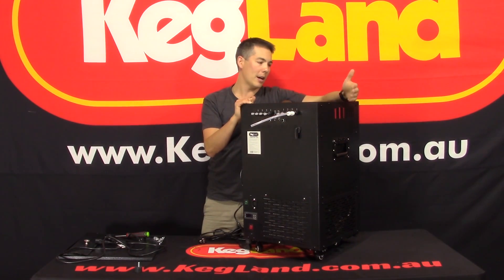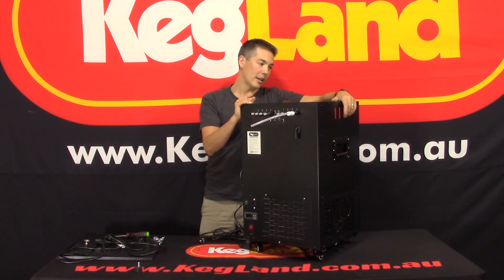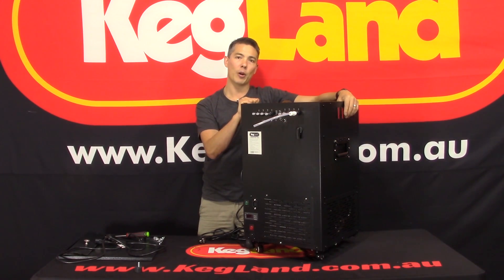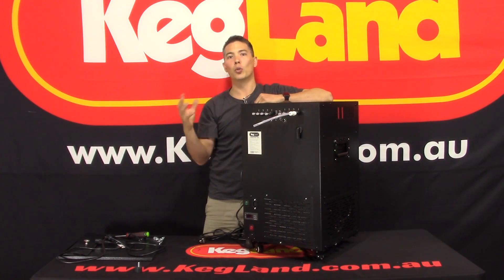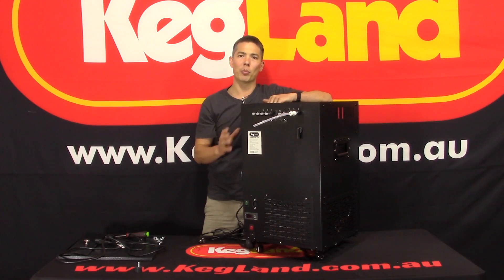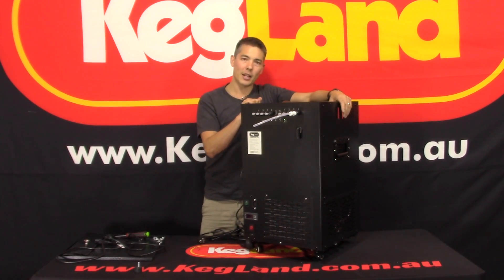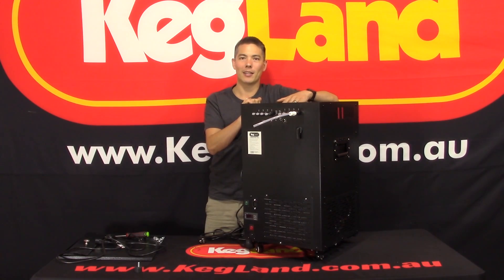Anyway, that's more or less it for the Icemaster G40s. If you've got any other questions just let us know — they're definitely a great little unit and probably one of the best value ice bank glycol chillers in Australia by a country mile. They're really well built with a powerful compressor — about 300 watts — and a cooling capacity of about one kilowatt. It's worth pointing out that many manufacturers state the compressor wattage on the unit, but there's also the cooling capacity wattage — this unit can pump approximately one kilowatt of heat out of the beer running through it, while the compressor itself is only a few hundred watts. Just something to keep in mind when comparing spec sheets. Thanks for watching!